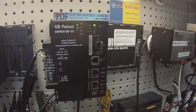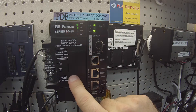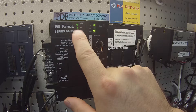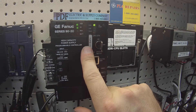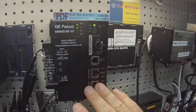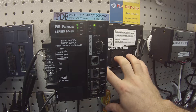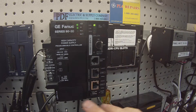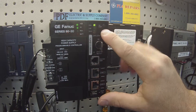As you can see I've already got it powered up. I'm going to shut it down so you can see what I'm seeing. When you turn it on, the first thing you should get is a green power LED to indicate that the power supply is actually supplying power. Then of course an okay light on your CPU to show that it's giving power to the backplane. If you wanted to, you could also fill the rack with other devices that have lights on them to confirm power.